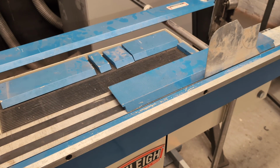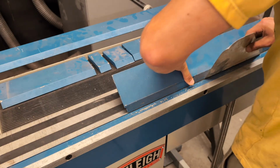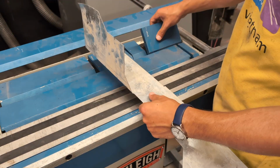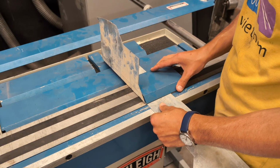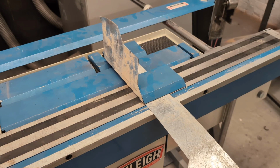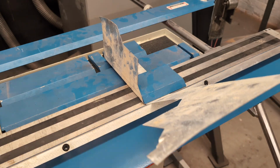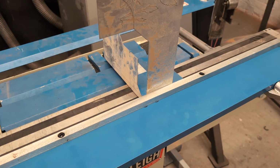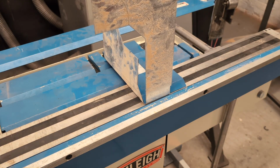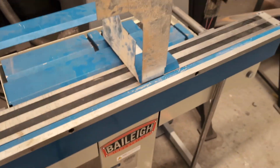And because this is steel, I had to account for a little more spring back. So now I'm pushing the off button and holding it for 3 seconds. And now we got a little finger in there. So now I'm going to turn the magnet on again. Lift up. And now you can see we've made this cool boxy shape.